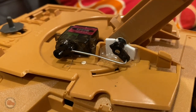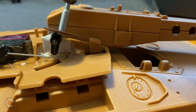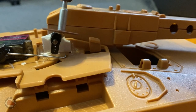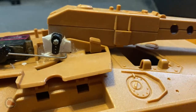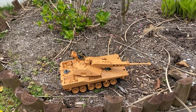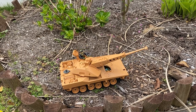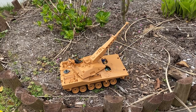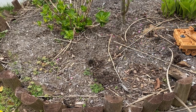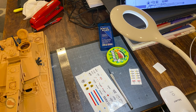You can see I'm now wearing a bandage on my thumb because of the accident. Here I'm cutting the servo horn — the piece of plastic that goes on the end of a servo — and I put that onto the shaft which will drive the elevation of the cannon. I'm going to connect that to the servo using a paper clip. You can get real servo wire which is a little sturdier, but I didn't have any so paper clip was fine — this didn't need to be really strong. As the servo's simple motor goes back and forth, it drives that little horn and rotates the cannon up. The problem is the turret on the Mauler is so short there's no room in there, so I had to keep cutting things off and grinding it down. I have the shaft going through the cannon through washers — that's what I used as a cheap bearing substitute. I really had to shave things down to make it fit, and it all worked. The turrets rotating, the cannon's elevating, the third seat looks really good. It's awesome seeing Heavy Metal in there, it rolls along, the motors are working good and the treads are working great. The last bit was some repro stickers, and called it done.